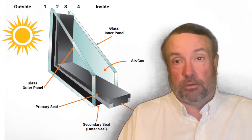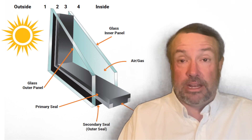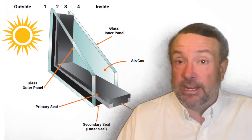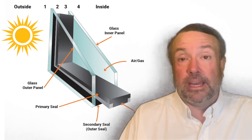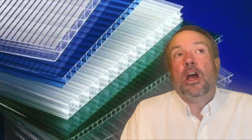This doesn't hold much heat. What people do to save more heat is they'll go to a double or triple layer. With plastic, they'll do a double air-inflated plastic greenhouse with maybe a foot or two of an air-inflated insulative area, bringing the insulation up to an R2 or R2.5. Or they'll use polycarbonate with air gaps somewhere between one and four inches. Or they'll go multiple-layer polycarbonate — you can go three, four, five, six, seven layers and still get light through.